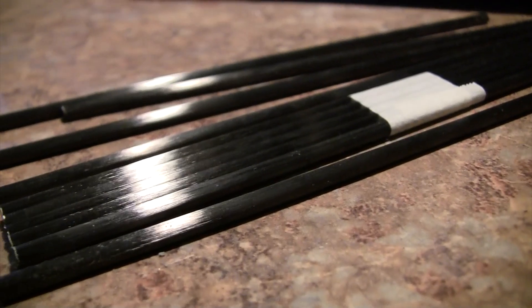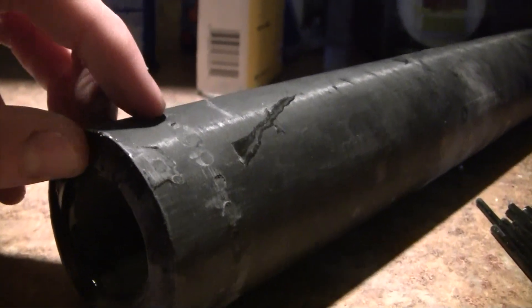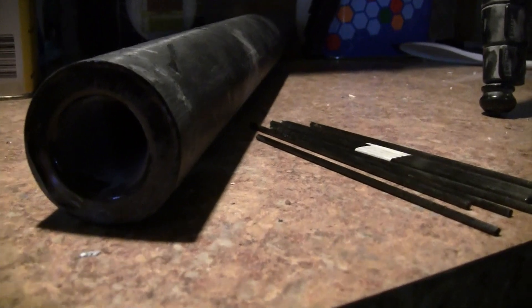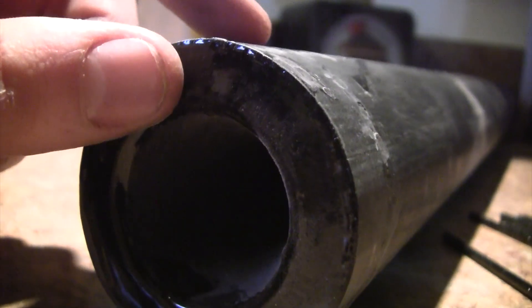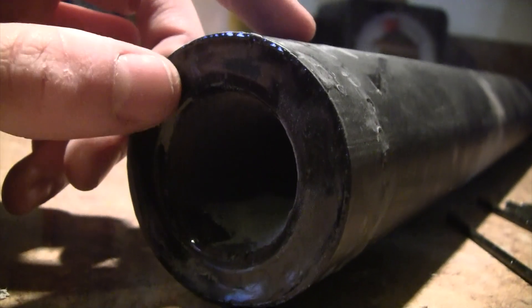Hey guys, so this is what I'm working on. I've got these really nice carbon fiber rods, eighth-inch diameter, and I'm using these as pins in a composite-cased motor. I've got 28 of these little carbon fiber pins. Carbon fiber will be better than steel because of weight, but also the carbon fiber can give just a little bit — it can bend ever so slightly — which will be good because the pins are going straight into the epoxy. If you had something that wouldn't bend at all, like a hardened steel pin, it would create pressure points in the epoxy and the epoxy would actually crack and shatter.